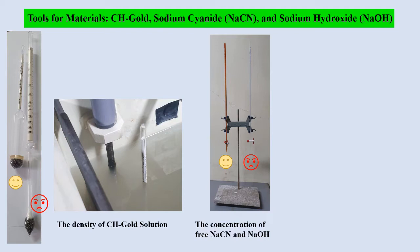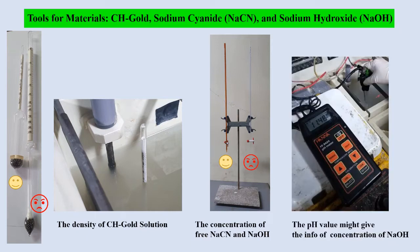Second, the concentration of sodium hydroxide is directly related to the color of the electroplating result. Check by titration and pH meter. I would like to recommend a more precise hydrometer. The concentration of free cyanide and sodium hydroxide should be measured using the titration method, requiring a burette and several chemicals. You cannot use a clear glass burette because your chemical is very light sensitive — you must use a brown glass burette. You can also use a pH meter for the concentration of sodium hydroxide.